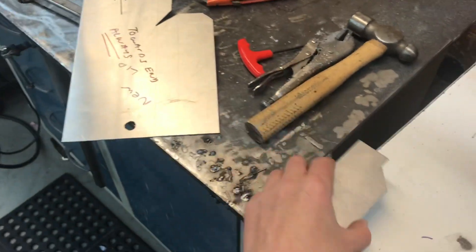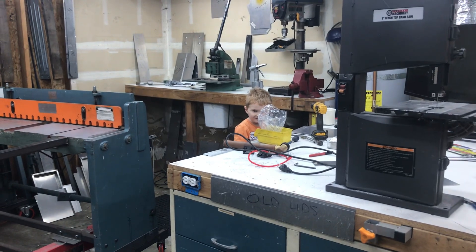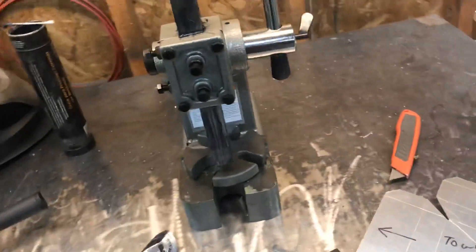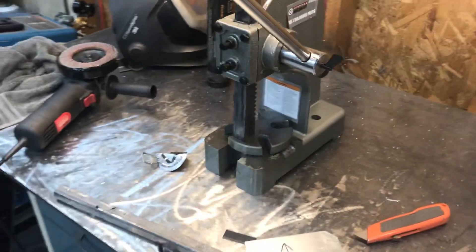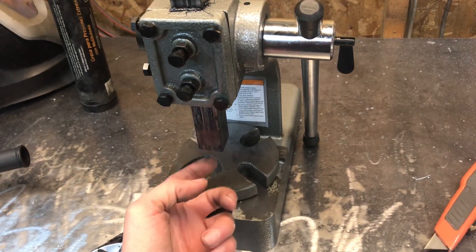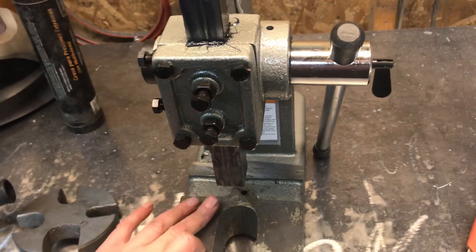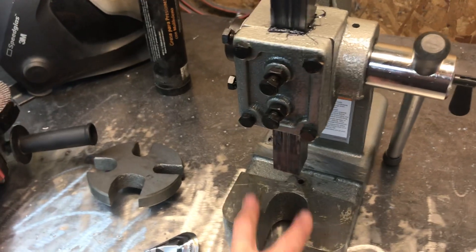A lot of why the new boxes are taking so long to produce is because I'm spending an enormous amount of time over at the notcher. And another thing about these notches is they've got to be really accurate — if they're not square, it's a problem. So speed and accuracy is what I need. These are like 60 bucks at Harbor Freight, so maybe I'll buy three of them and have them lined up so I can just knock out what I need. I'm going to thread this from the bottom to hook the pieces on, drill and tap it. The receiving part I'm not sure exactly how I'll build — maybe I'll put like 3/8 inch plate down here. You have to have hardened tool steel, basically the exact opposite shape, for it to punch down through. We'll see how that comes together.